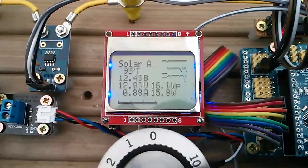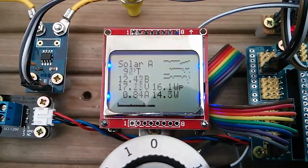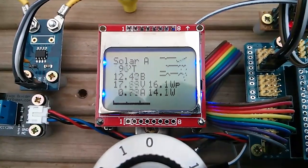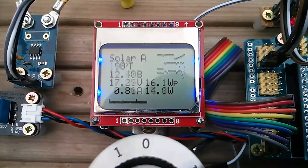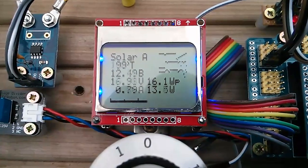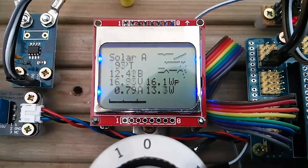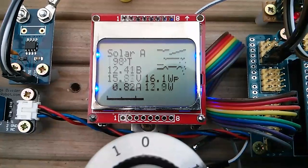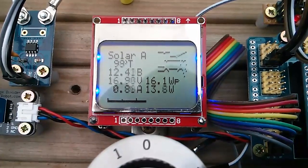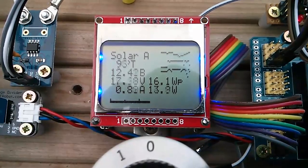13, 14, 15 watts now. The difference you may have noticed is that the potentiometer is on zero. What I've done is set it so that when it's on zero — because there's nothing that can usefully be done at that end of the range — I've told it to go into my new MPPT tracking algorithm. It does appear to actually work.